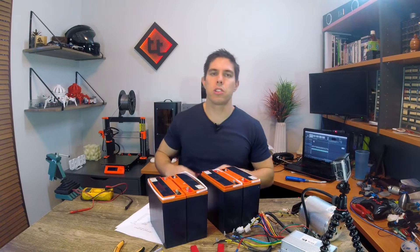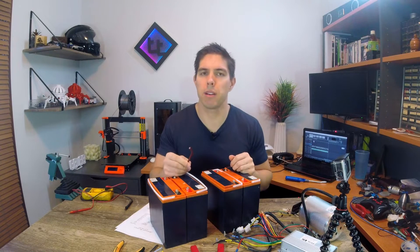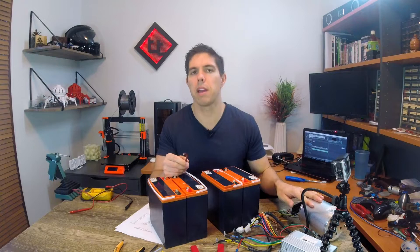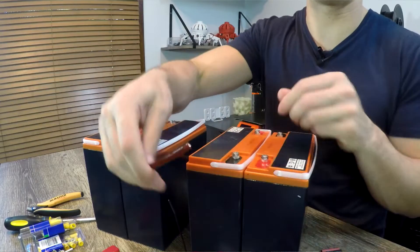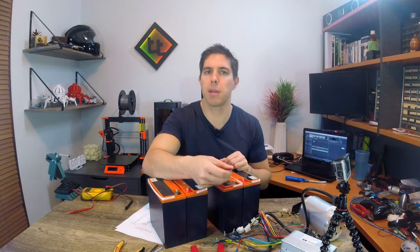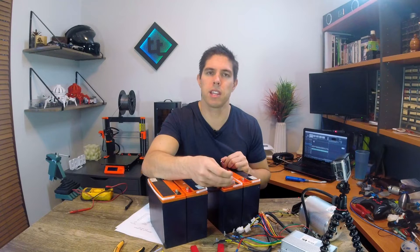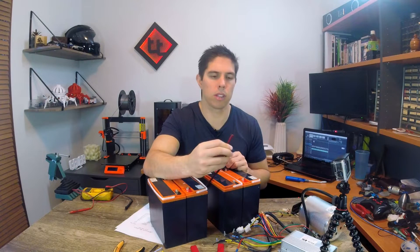To do this wiring, we want some really thick gauge wire. On paper, if this was to use its maximum power with 48 volts, it should be able to draw 37 and a half amps. So the wire I have here is very, very fat. This is recycled cable — it was set up for a stereo in a car that I purchased, and I ripped that out and have all the cabling left over.